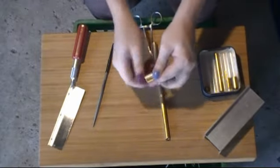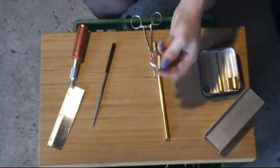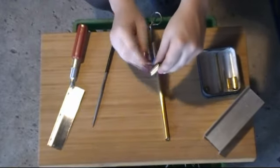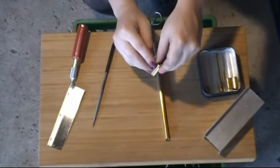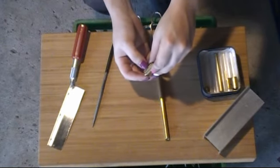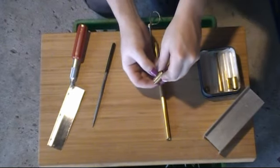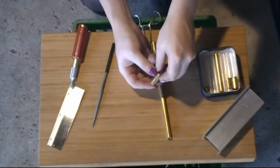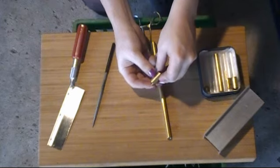Perfect. Okay, that's good, because I can demonstrate the next bit. For drilling the holes through it, it's not aligned yet. You get everything aligned, and then you drill those holes through here, at least the pilots. That way, when you're actually doing it, you know they're going to meet up and align. And I'm probably not going to be able to get it on cam. My battery's already gone. Oh, this camera sucks. Anyway, so you drill the holes through those guide holes.